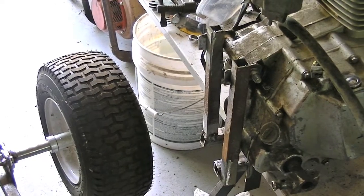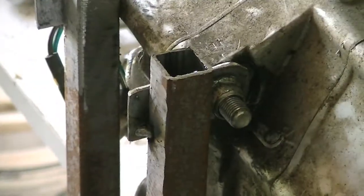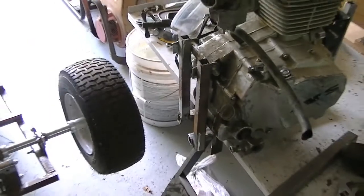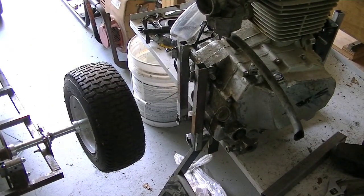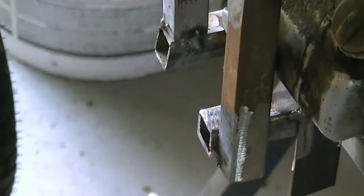These two guys are now on here. I've got the mounting bolt right in there. I'm going to do another tack because it was a little bit off — I'm going to bend it and tack it again. Once I do that, I think I'm going to start grinding down all those uneven edges on the ends.